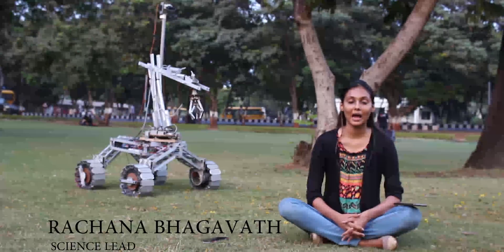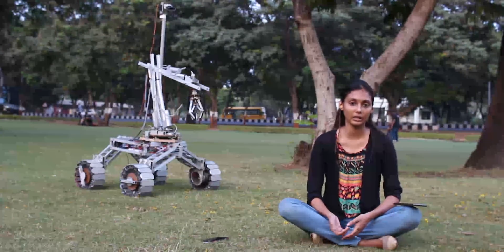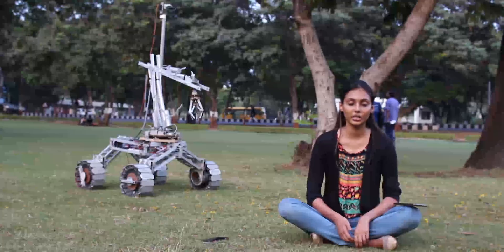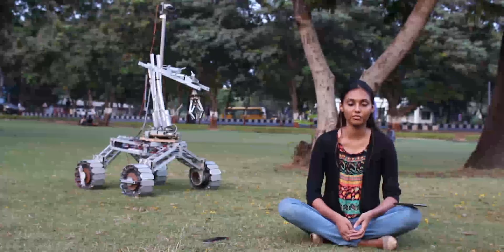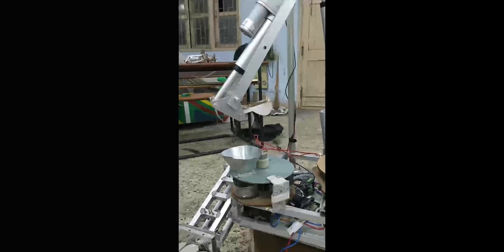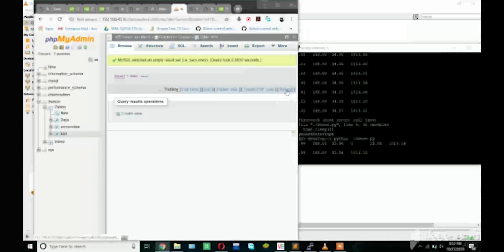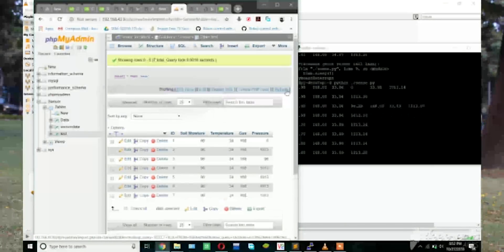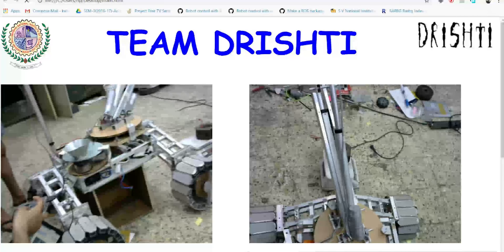For analyzing and selecting appropriate tasks with potential biological aspects supporting microbial life, the manipulator is equipped with a 3D-printed end effector capable of collecting soil samples up to a depth of 50 to 70 mm. The storage containers used for collecting soil samples are designed to be airtight. The rover is also equipped with sensors for measuring parameters like temperature and pressure, and air is monitored for the presence of benzene, alcohol, and other gases. The data is transmitted to the control station and a GUI is designed for displaying this data.